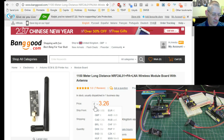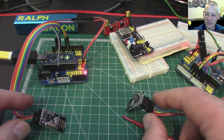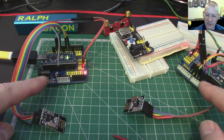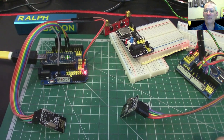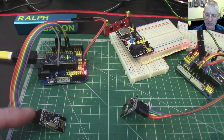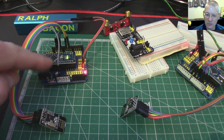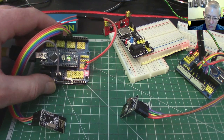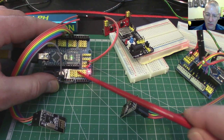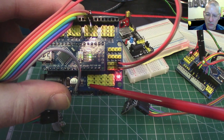Let's get back to the workbench. We're going to communicate with these two — it's only across six inches but it works for about a meter and a half the way I've got it set up. You need two identical Arduinos and two lots of dupont cables — females at one end. I'm using clone Nanos on development boards, which I find much easier to use.